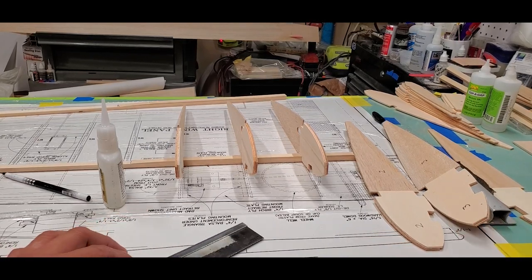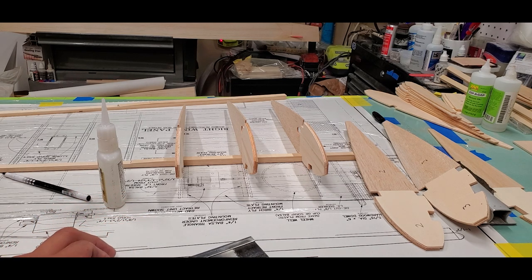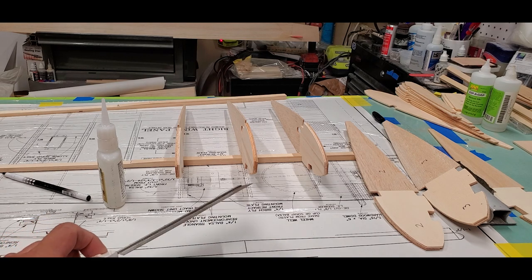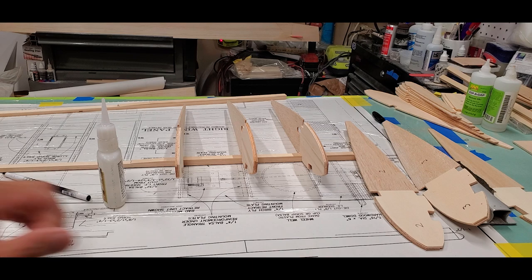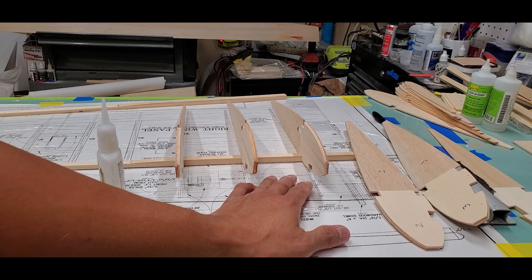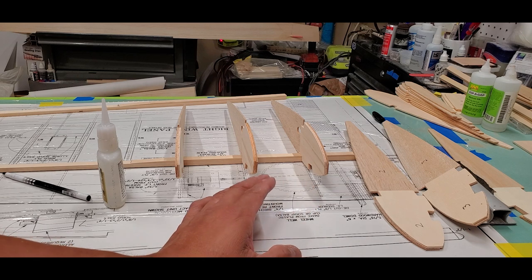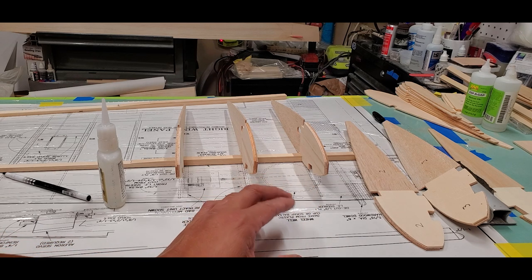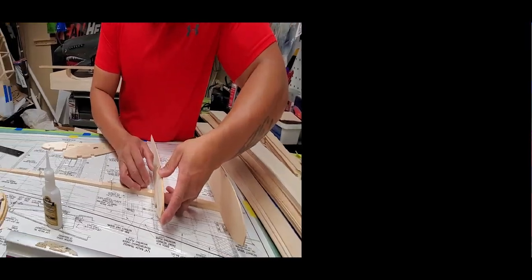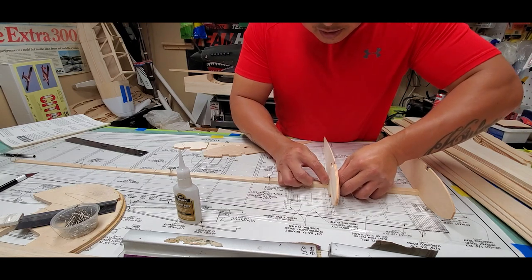You're not really going to see it on the right-hand wing panel, so you're going to have to pull out your left-hand wing panel plans. And if you're going to do the fixed tail dragger version landing gear, you will see on the left-hand side plan the actual location of the block and also all these doublers and stuff. The right-hand side wing panel shows the retractable landing gear details. Well, we're just going to go ahead and mock things up here real quick. Get everything all situated.